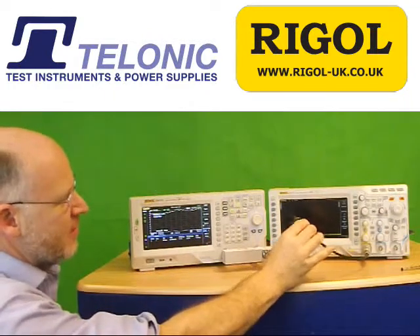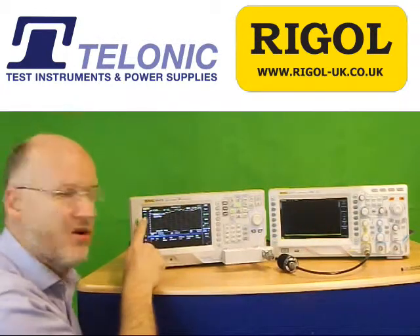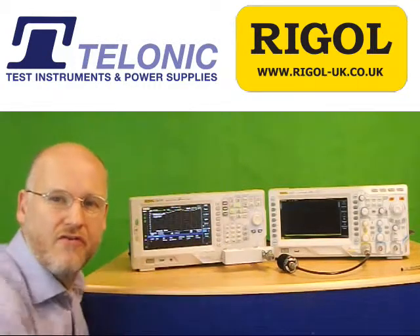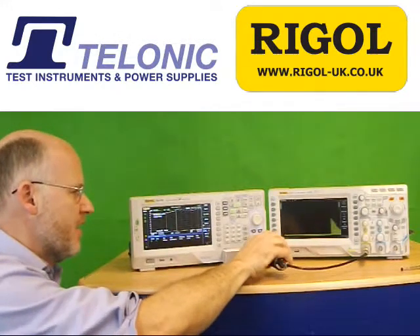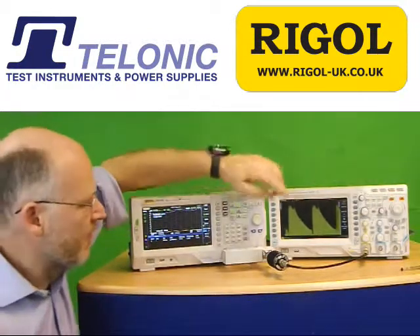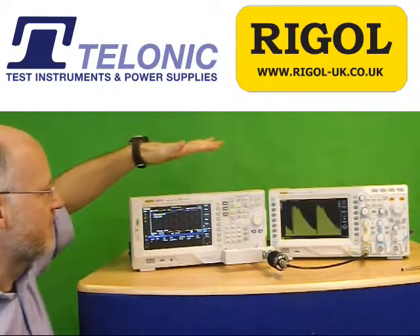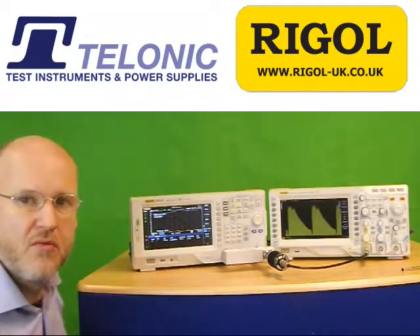Now I'd like to investigate this little dummy load — just to see what its SWR is across the whole range from 9kHz up to 500MHz. Let's simply plug it into the front of the bridge. I'm using the scope here to show what's happening on the other side of that attenuating load, and you can see the tracking generator output just as an illustration. You don't need this to make the measurement — the VSWR measurement is all being done by the DSA815TG and the VB1020 bridge.